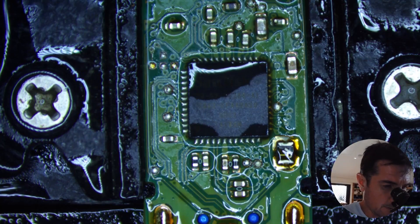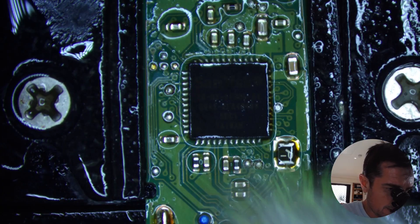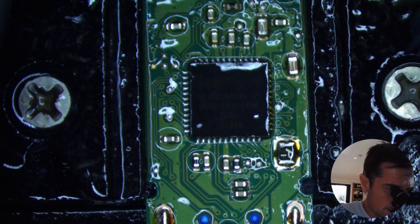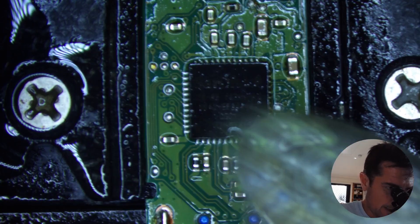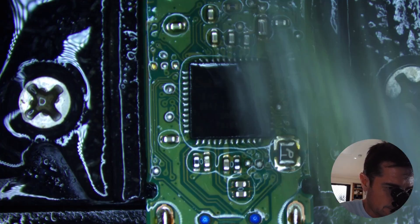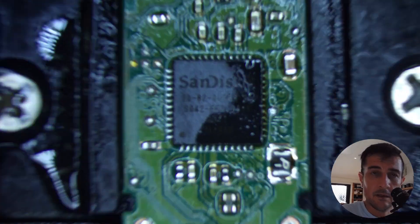Because it's a bit warm, it's going to evaporate the isopropyl alcohol quickly, so just nice and gentle when we're cleaning. We're also looking for any pins or anything that's moved out of place. So far it looks like it went to procedure well. I think we'll zoom in and try to get a nice closer look at these pins, because if they're not soldered on — if we're missing one pin or if one pin's a problem — we could be in trouble.